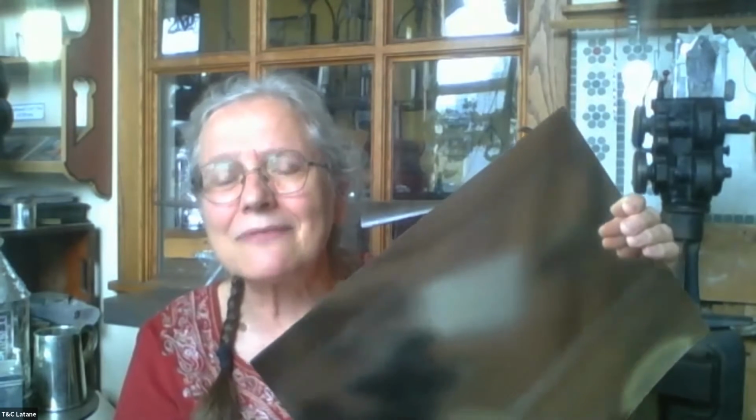Kitty, we have just a question in the chat. Kathleen is wondering what gauge your tin is. This particular piece is about 28 gauge. 28 and 30 are fairly standard gauges. 30 is, well, I think I'll show you a lantern later that was made with 30, but it's getting kind of light. And the lighter it is, the more reinforcement it needs with wiring or with swedging. And I'm going to show the punching, like, well, the little triangles on that lantern we looked at earlier were punched.